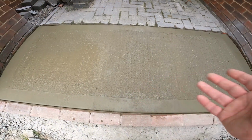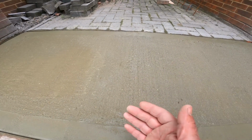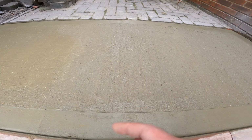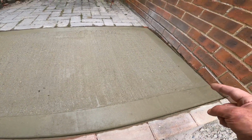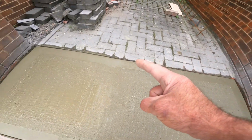Yeah, concrete slope path there, all finished there. I give this a tamp finish, just a really light tamp finish going across there. I use my level for that. I also edge it all out there with the Marshalltown edging trowel. That's really effective too, all the way around.